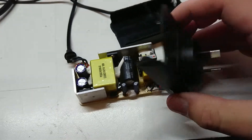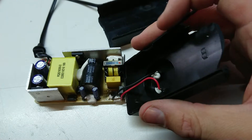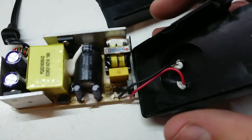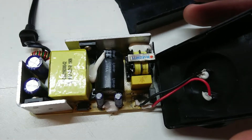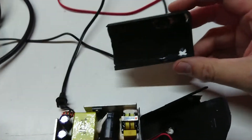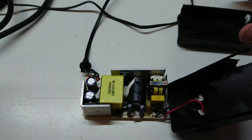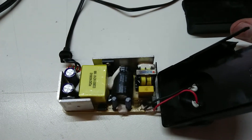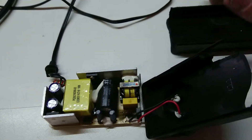Confusingly there's no earth wire, so I think in this case it just dead shorts across to neutral. If they've put a too-low rated MOV in there, it's just going to blow its guts out, which is what happened here. The result is not actually dangerous — it just simply stopped working. I found there was no route back to ground, active, or neutral from the DC side, so the isolation remained intact.